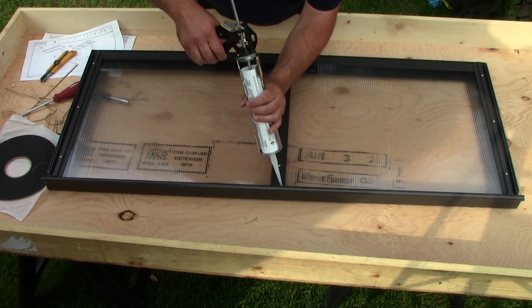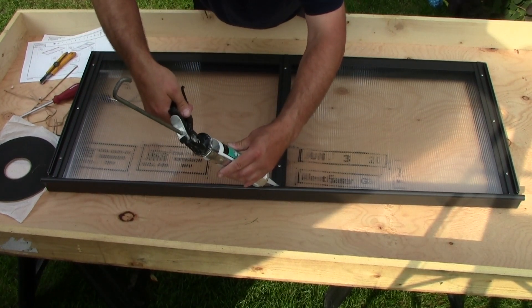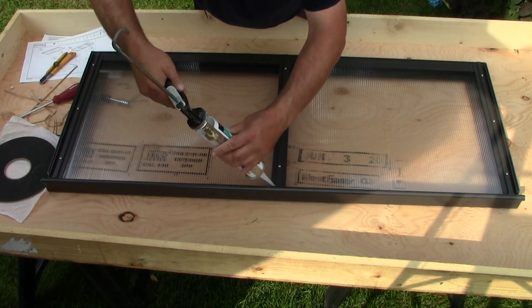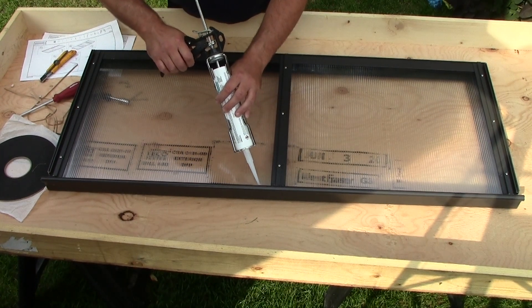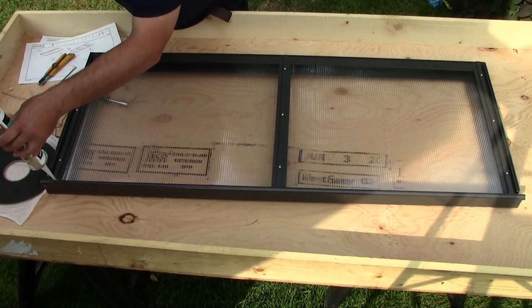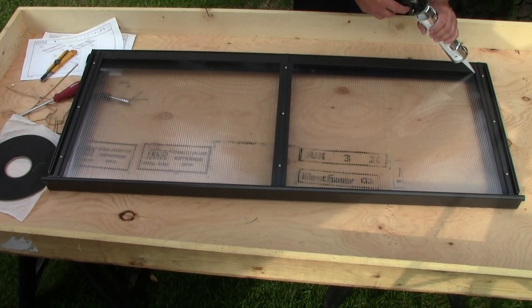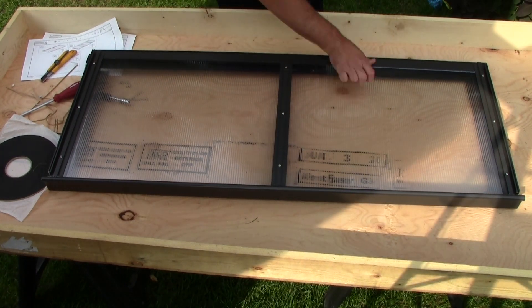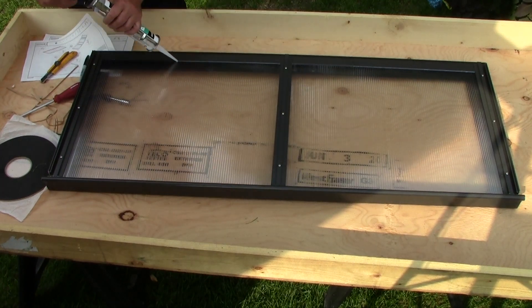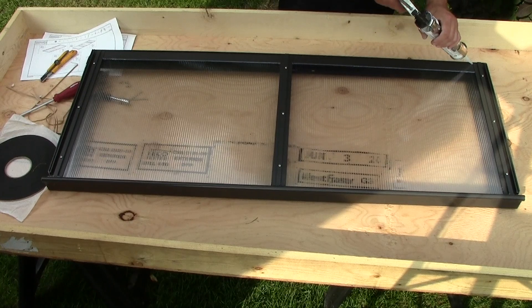Make a little small seal here between the polycarbonate and the hinge. You can seal again on top of the molding, but it's not necessary because it doesn't communicate with the greenhouse. Then do another seal on top. Make another seal here between the polycarbonate panel and the H channel. The last one is on the bottom, just between the H channel and the gutter.